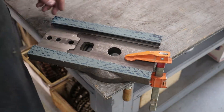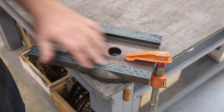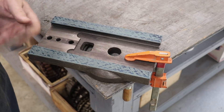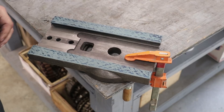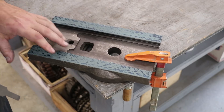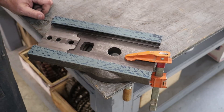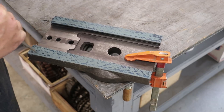Made several more rounds here between scraping and going back over there and bluing it up. This is kind of where I'm at right now — we're getting real close, we've got pretty good contact pretty much all the way through here, maybe just a little bit light in the center. I'm actually switching over to a little bit different, more narrow cutter with a wider radius. I'm wanting to take not quite as wide a cut each time. Basically what I'm trying to do is kind of cut these little marks that are on here in half into smaller marks — turn one big blob into two smaller blobs — to just get this down to size.